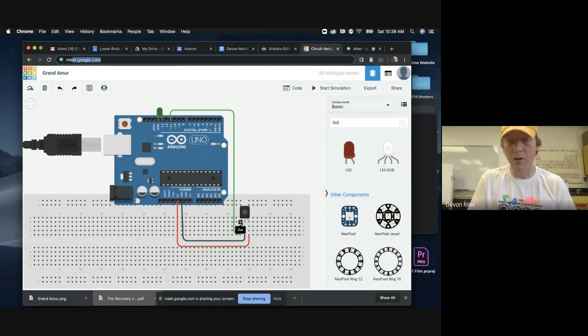And then we've also got what we call our data line. And so the left side of this is going to be connected to our Arduino, and that's actually where information is going to be getting sent back and forth from the sensor to the Arduino. And so that's going to connect to a wire, and that wire is going to go up, and it's going to go into the digital 11 port on the Arduino.